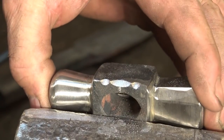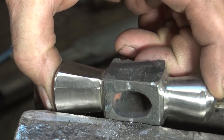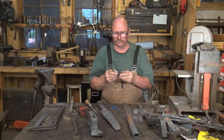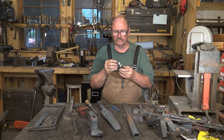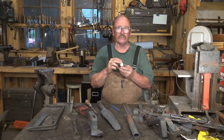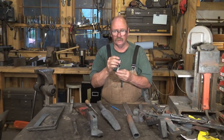That's really all I'm going to do to that, but I am going to do that to all four sides, so we'll turn it around and take the same approach on the opposite side. That little bit of file work is done and I think it really jazzes up the hammer a little bit. Now I need to go put my touch mark in very carefully — would have been better if I did that during the initial forging, but it shouldn't be that big of a deal as long as that's all I do and I don't mess up the faces. In some regards I'm actually glad to run it through the forge so I can scale up the sides a little bit so they don't look quite so much like they were ground and machined.